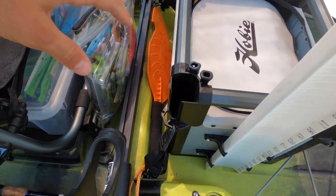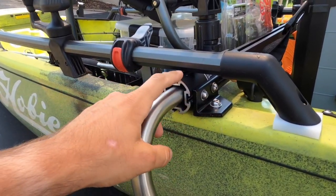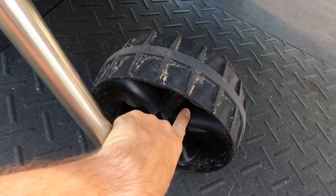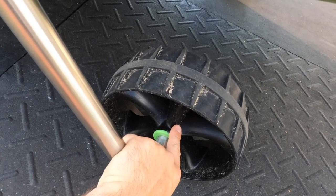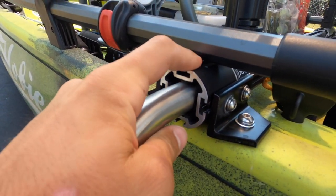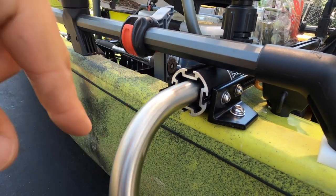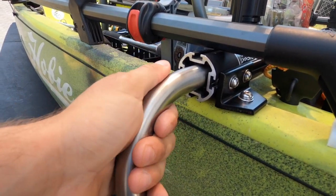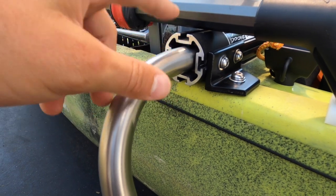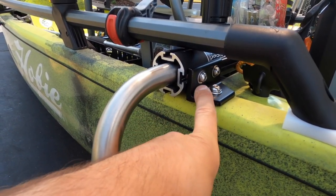Moving up, right here we have our track mount from the Boondocks landing gear. With their new HD hardware, this is a metal joint holding an aluminum knuckle with an arm down to the HD wheels — rubber-lined hard plastic. They don't float, which actually makes it easier to get them on and off while in the water. With the HD system, two bolts and a lot of Loctite and lock washers, this doesn't move like the 2018–2019 models did with Boondocks. This is solid, making it easier to slide the joint in and out when getting on and off the water. I used the old system with plastic gussets on my PA-12 and it was impossible to get on and off on the water. Give Boondocks another chance — you can upgrade to the HD hardware kit for about 44 bucks. Totally worth it.